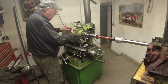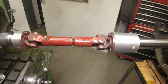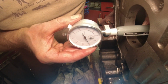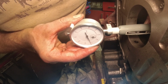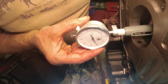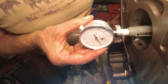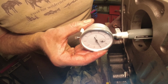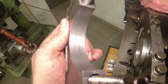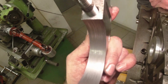It took us a whole day to build this rig. We got minus 200. See it here go to negative? And if I scoop it over to the center, we also got minus maybe 1.5, and then I scoop over to the other side, and that's where it's a little shy. It's a little too big by 100ths, but it's still in the negative. The surface finish, it's not the smoothest, but it looks very even.